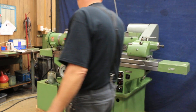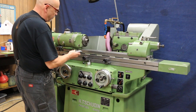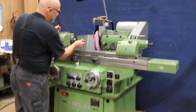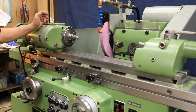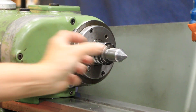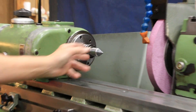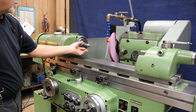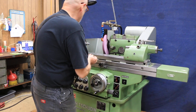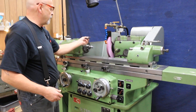The basic spindle itself is a Morse Taper number 4, and you have a reduction sleeve that brings that down to a Morse Taper number 3. Then you have a knockoff nut here to pop it out again. The center is a little long — I would use something probably shorter. And then you can have a drive dog on here, something along these lines, for driving with the dead center.